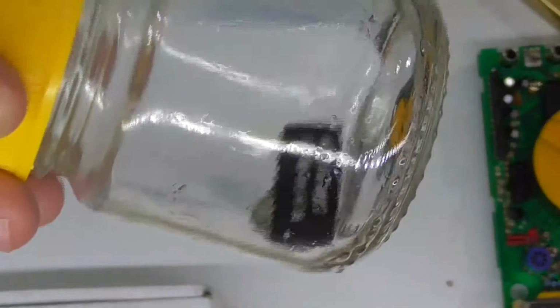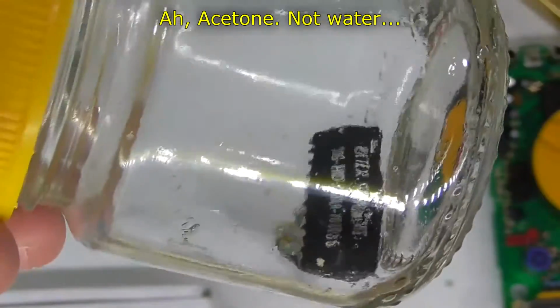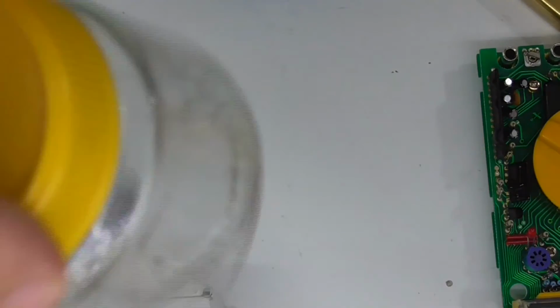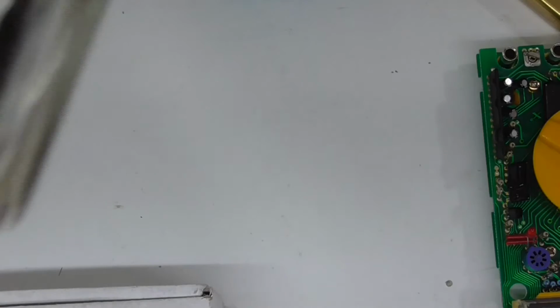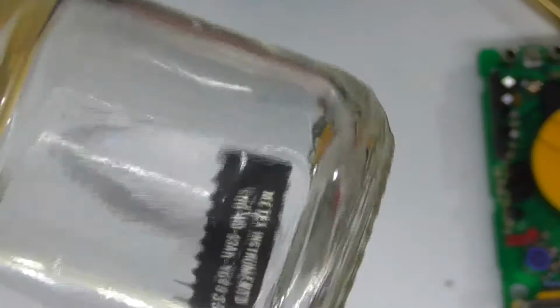So it's been in there for about 6 hours now, and you might be able to see that there's a slight tinge to the water. There's a tiny bit of debris in there, but interestingly enough, side on, I've taken some camera, I need to move the video camera, but there's two things. It's a thudding sound now instead of a tinking, hard, so it's obviously softened, but the top half of the module is bubbled out. So on the two ends, on this end and this end, it's bulging.